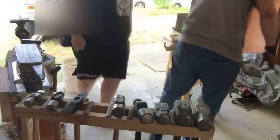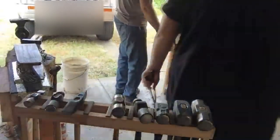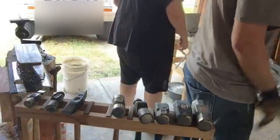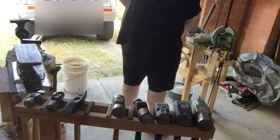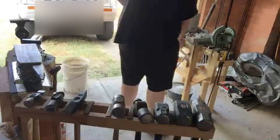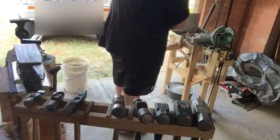You can use that to balance it. Basically, its angle can change, distance can change, height can change, and that lets you rest the piece in there at the right height. But basically, you just want that head hot. The rest of it can be hot too. It's fine, but it'll actually be better if the rest of it's a little hot, because then the neck is softer and it will be less prone to cracking.